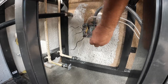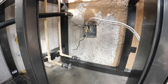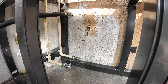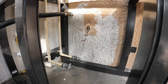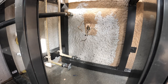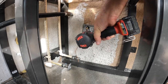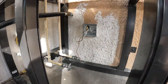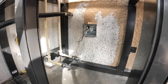What I did was pre-wire everything. You may ask why I use three-wire on everything — it's what I had, and also for running switches it's easier to run the black up to the switch and then run the red back down to the device being switched. So I ripped off the old box that was on the house and put back a new box, then ran a jumper wire over to the distribution box that will have a switched outlet for the disposal.